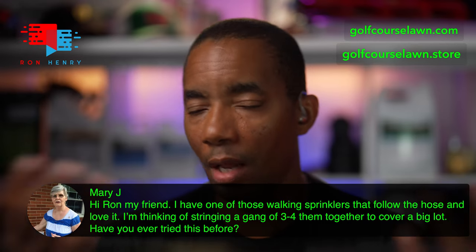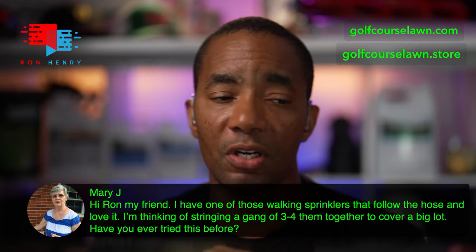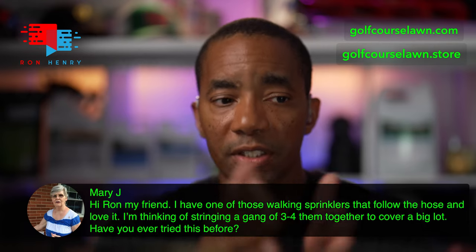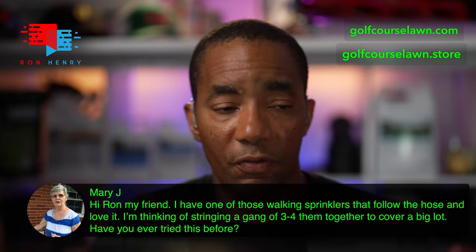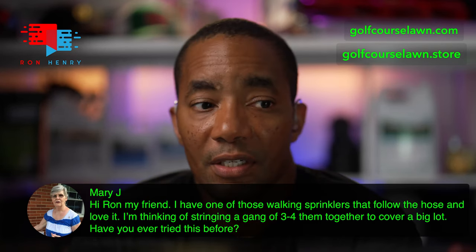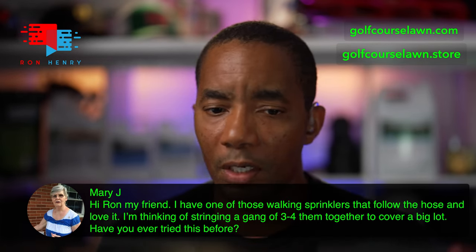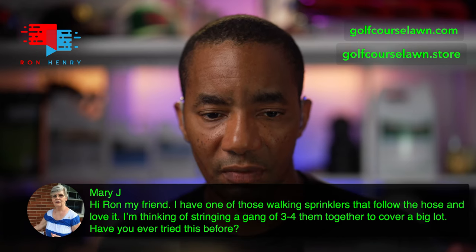One works well, I'm not surprised at that. Two, maybe, but with three or four, I think you're going to find that you don't have enough pressure to run all of them. Because literally you're dividing the pressure in four, across four different outlets at this point. So get one more if you want to try it, and if that works, that's probably as far as I would go. Three or four, I don't think is going to work very well. So hope that helps. If you have any other questions, definitely let me know.